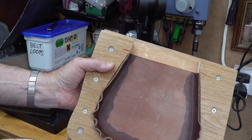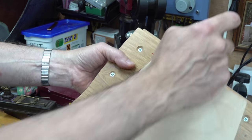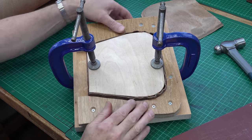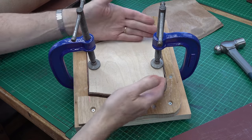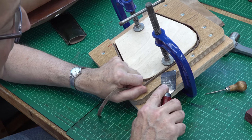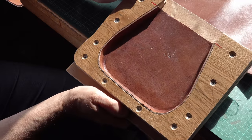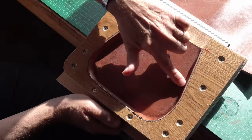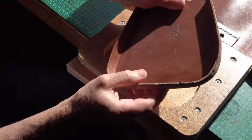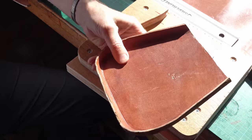That has actually worked. That's my end piece — it's got quite a nice smooth margin there, though it's a bit ruffled at the corners. If I was making this again, I think I'd actually make it a bit tighter fit. I've popped a couple of G-clamps on to keep the pressure on, and I'm just trimming off the excess, using the outer mould frame as a guide to get a nice even cut at the right height. About 12 hours later, it's definitely taken the shape well. It's quite a tight fit coming out, but it's done what I hoped — a good wall all around it. One more to do.